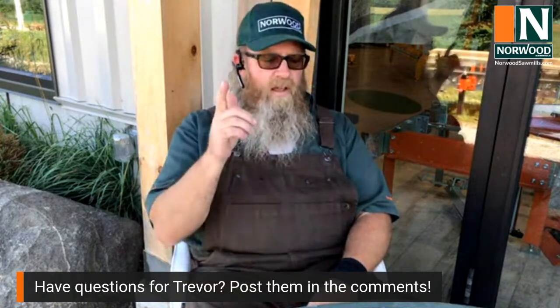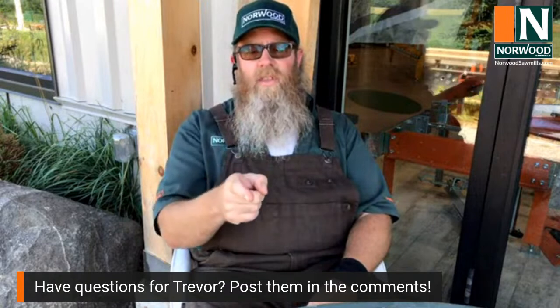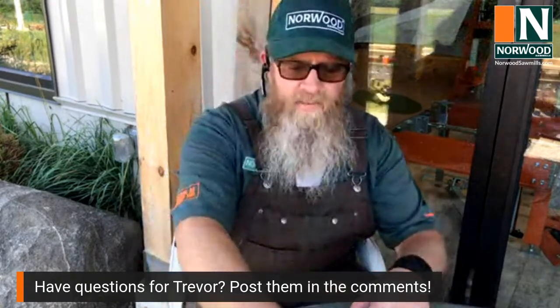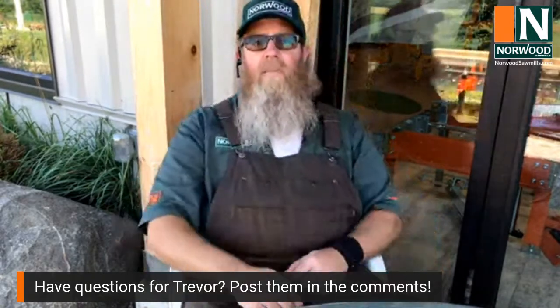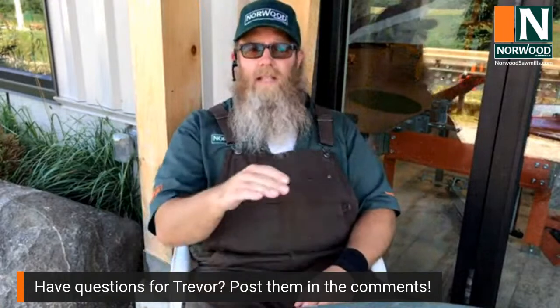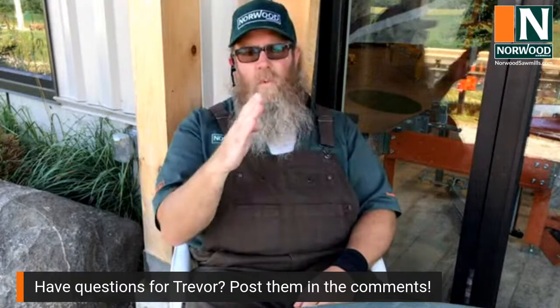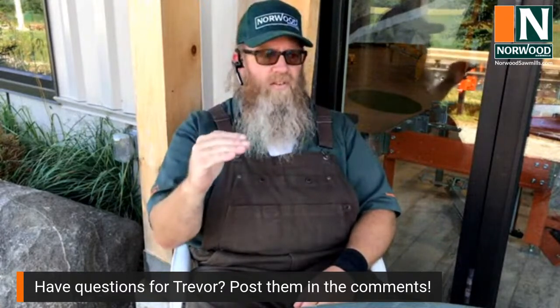Really good question. Frank, I didn't finish my answer to you on that spruce way up there in the north. 787, hands down, I think is the right blade for that, because the knots on the spruce versus the clear part of the lumber are so hard that when you make that transition, the blades just want to surf around them. And the more stood up the tooth is, like I was saying, the better off you are about making those transitions, okay?